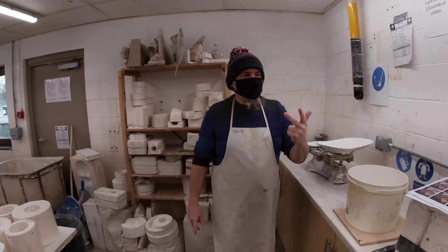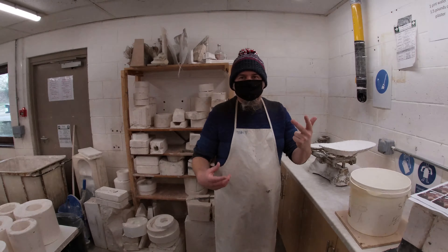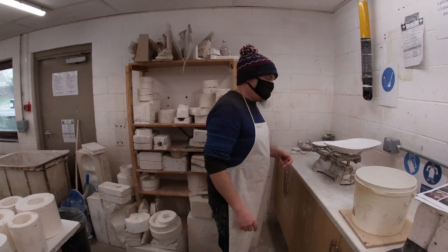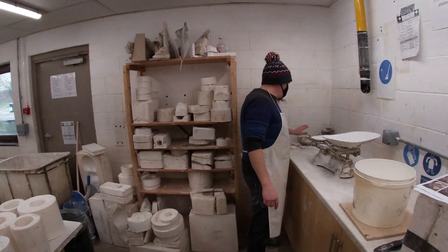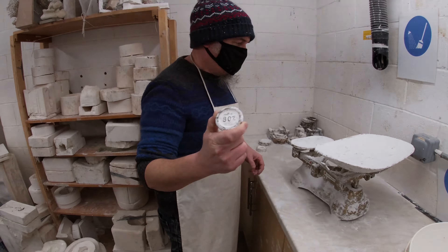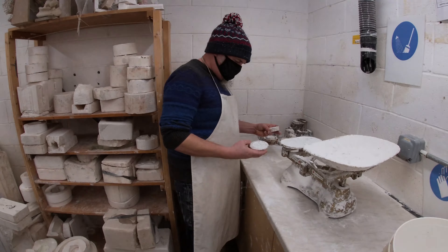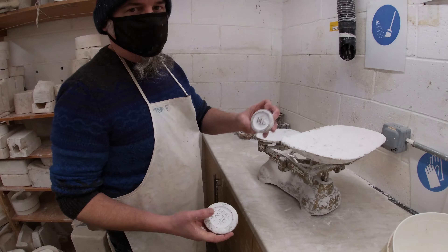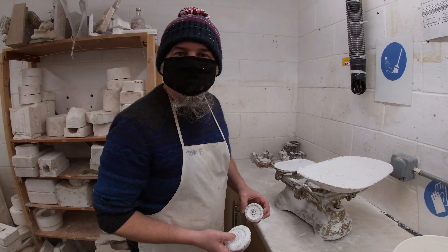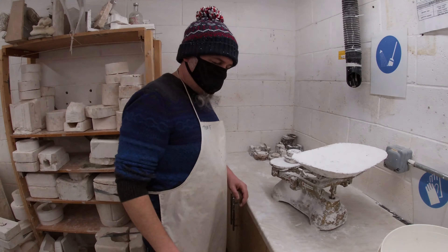If you have six pints of water, you halve the six to get three, then add that three to the six — that tells you how many pounds of plaster you need. Pounds are awkward because they're made up of 16 ounces. The scales here show ounces — eight ounces is half a pound, four ounces is a quarter of a pound. Some scales show two LB and one LB — LB is the abbreviation for pounds. So we need three pounds; we place those weights on that side of the scale. The plaster lives under here in a nice container.